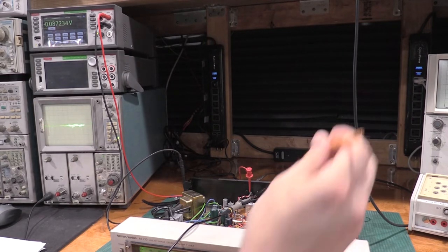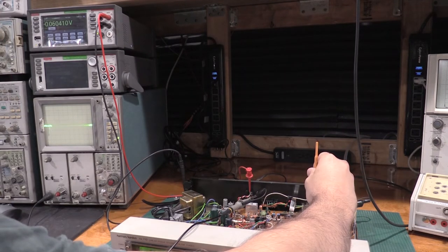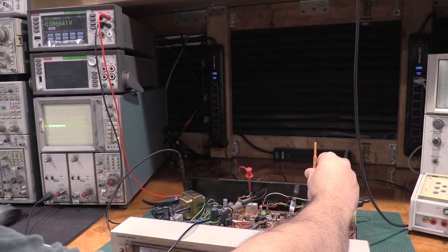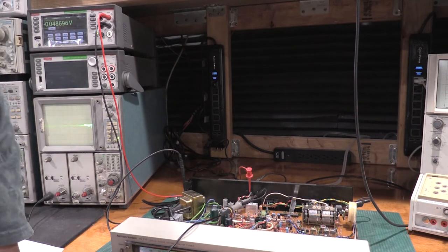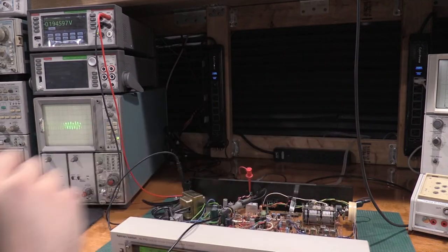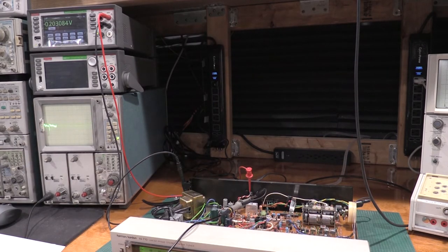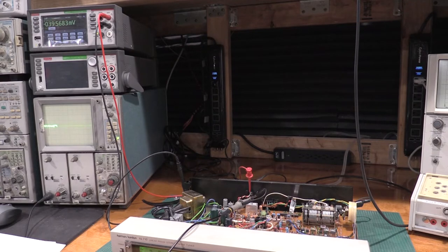And now we adjust this tuning capacitor right here. Does help when you change the signal source to be the correct one. 400 kilohertz. Roll this back up to 1600. 1600 kilohertz. There's our signal. Down to 540. Frequency 540 kilohertz. Okay, so this is doing the dial accuracy.